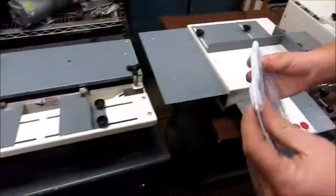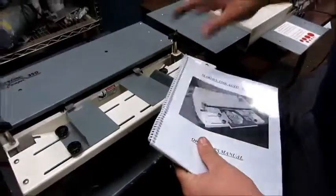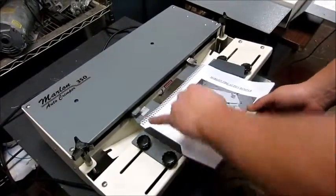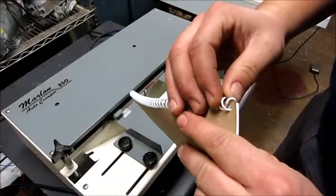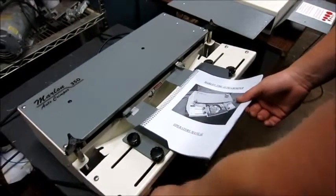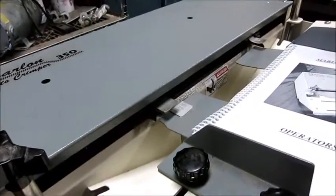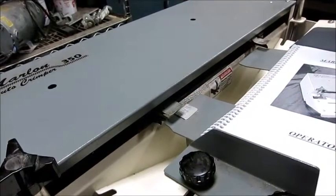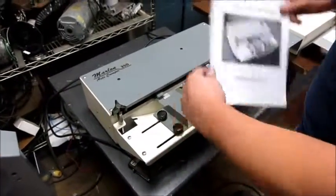After you've done that and inserted it on the last machine, there would have been some excess coil. You put it into this machine here — these are both knives right here that cut it and fold it under. You can see that's folded under right there. So you take it after it's inserted, slide it in on either side, and it'll just cycle. It actually cuts and crimps it under. These guides can be set up for any size; you just slide it in, hit the button, and you have a finished book.